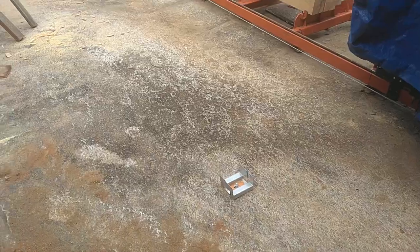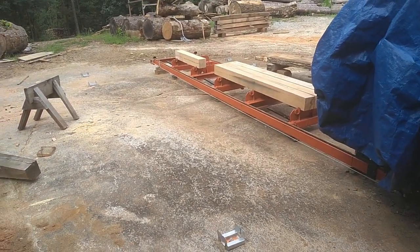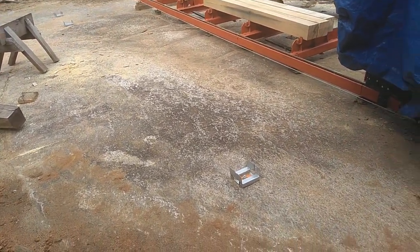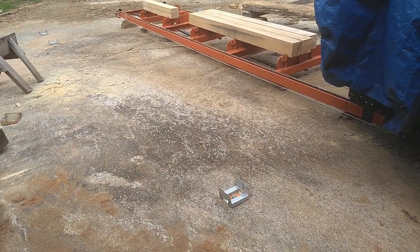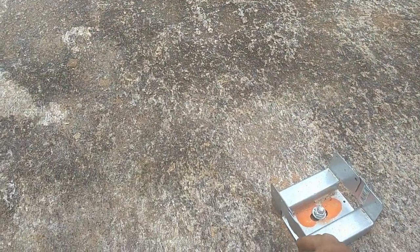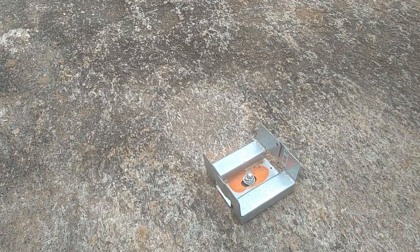I've been cutting timbers, and we're getting ready to start setting things up. Let me show you where we're at. First, let me say my sawmill is on a granite rock. That's right, one rock. And so we scraped more of the rock off, and what we did is we positioned these 6x6 post holders. I seem to like them. They work out pretty good for me anyways. They're really only 5.5, so I have to notch the ends, as you'll see.